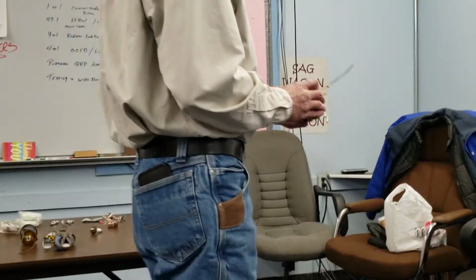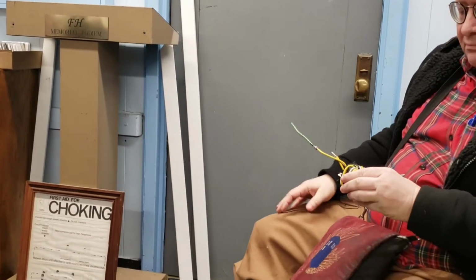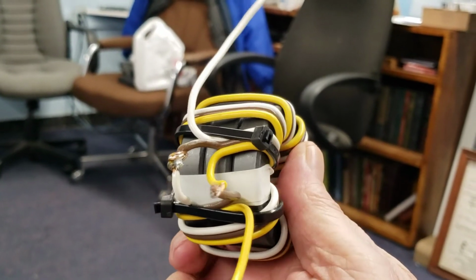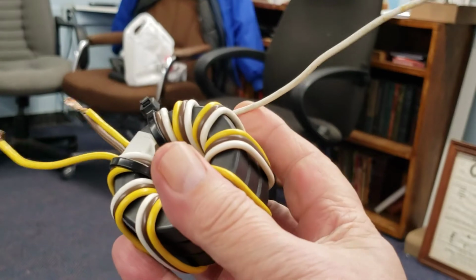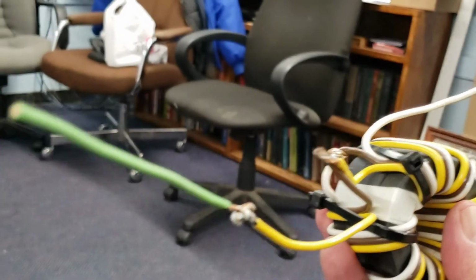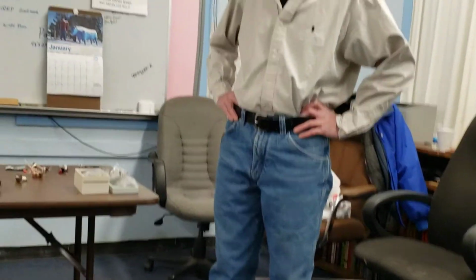And this is an example of the 9-to-1, and I've got a drawing up here if anybody wants to look at it once we finish up here. But I'll pass this around as well. This is a 9-to-1 for a random end fed. That one, I'm assuming, is probably capable of doing full legal limit, 1,500, with 331 or 343 cores and that gauge of wire, easily do that. The only difference with the random wire is you have to have a tuner.